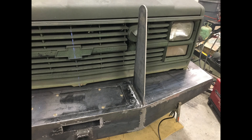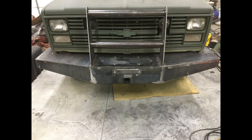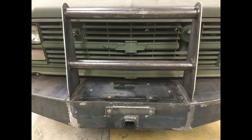I put the second upright on and got the crossbars welded in — just some pipe cut to length. Not DOM or anything, just pipe I had. For this application, since it's not safety-rated, I didn't need DOM; it should be plenty strong enough. Looking at the single uprights, they were okay, but they just didn't look beefy enough to me, so I went to modify.